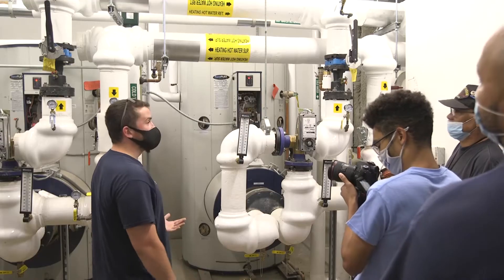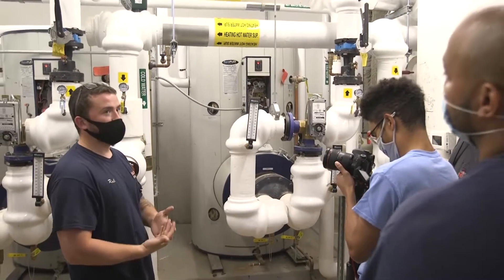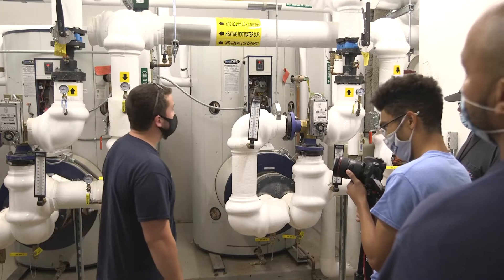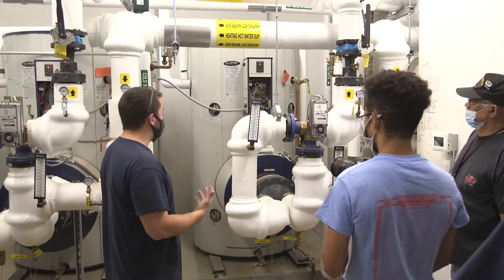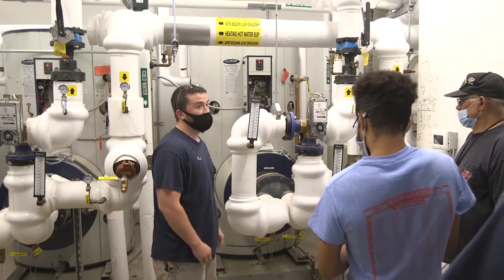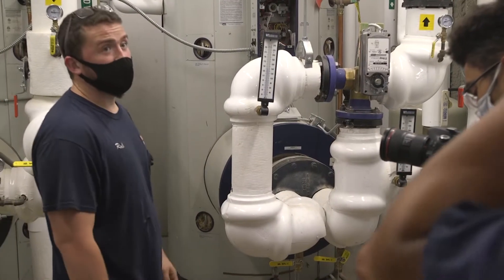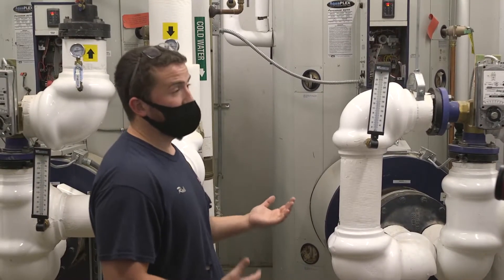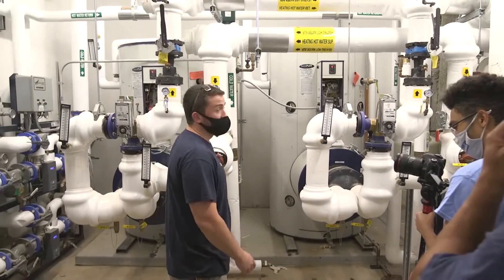The typical scenario would be you're getting complaints of no hot water, you come in, these things are not in alarm, but at the same time they're well below their set point — struggling at 110, 115, 120 constant, not improving. I would look at the temperature of that boiler water because they will be directly affected by that. The same symptom — they're operating but not operating well — could be a fouled heat exchanger. If this heat exchanger gets dirty or clogged on the inside, or fouled up on the outside, it will prevent heat transfer and you'll get poor performance. That can only be corrected by opening it up and cleaning it, done on an as-needed basis. Factors that affect that include the quality of the water and how much new water you're bringing into the building.